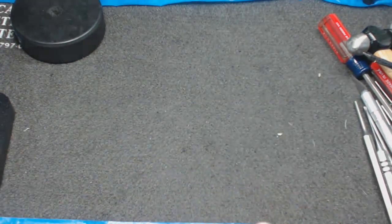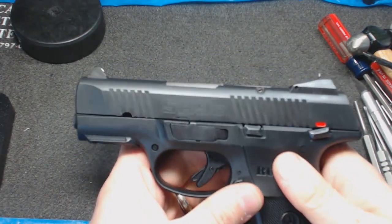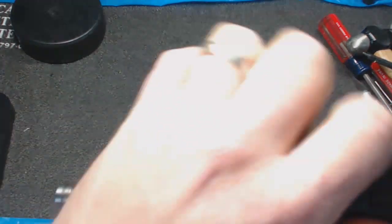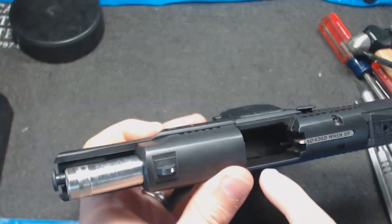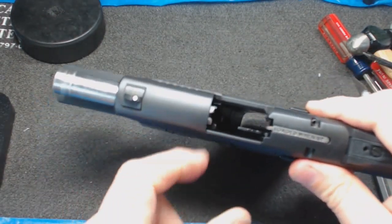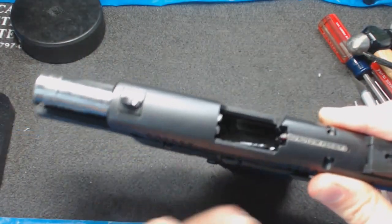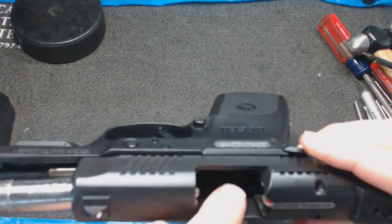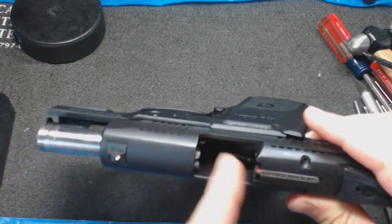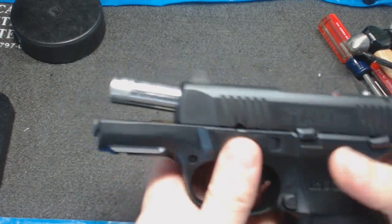this is takedown of this is fairly straightforward. You do have to have the safety off. Also, you should lock it back first and then push the ejector down. So the ejector is actually on a big ramp. If it's down and you put a magazine in, that also pushes it back into position. But down is the takedown position. That'll hold the sear away from the striker for us.